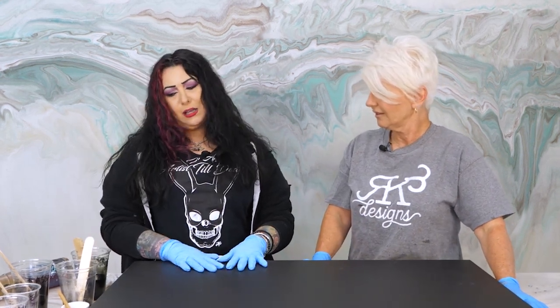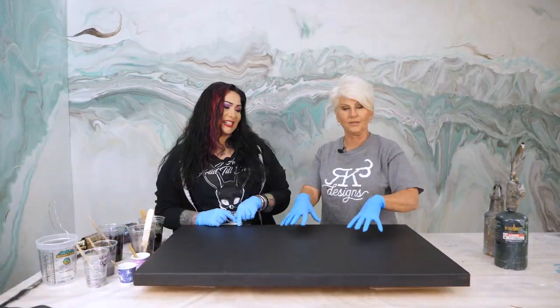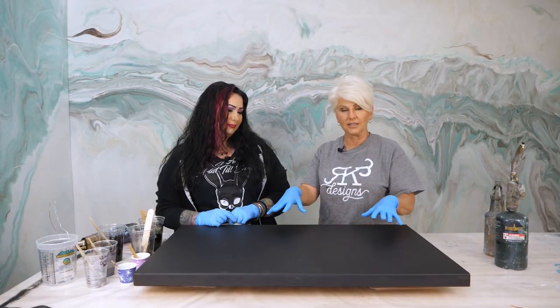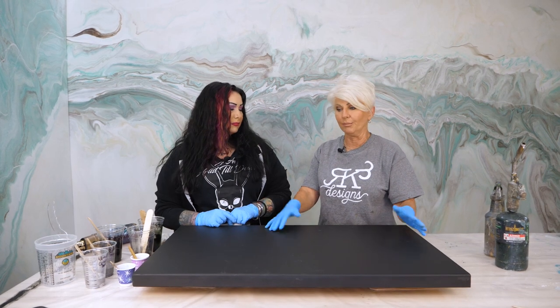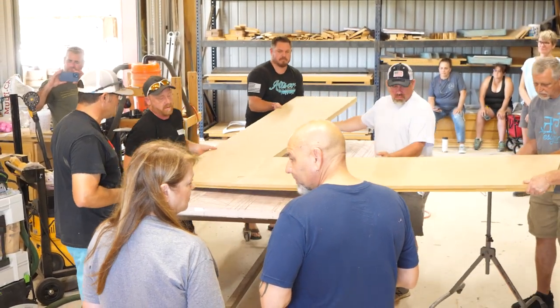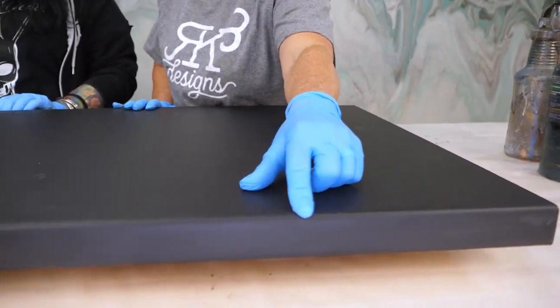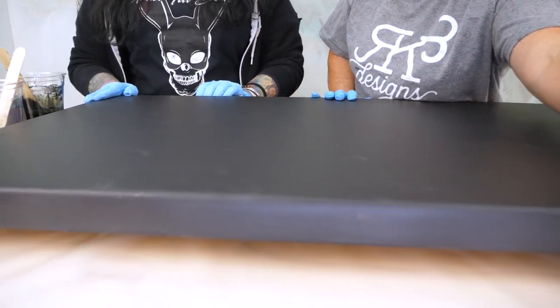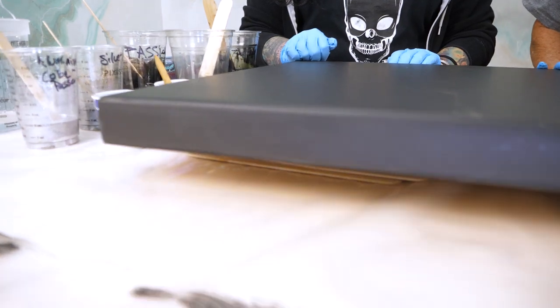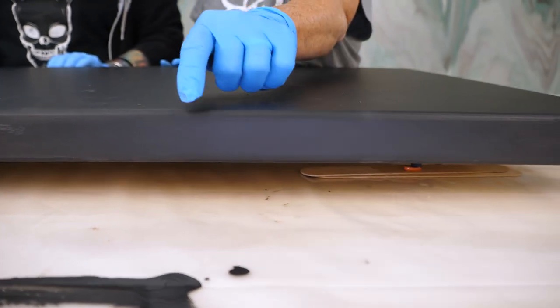So I named this Hollywood black marble and it is simple. It is black base and silver veining with some bling with a little hollow. What we've done to this point to get the substrate ready — we have a piece of countertop fabricated by our students, made out of MDF. It has been rounded over on the edge, a quarter inch round over and also on the bottom edge, so the epoxy can roll over and not build up surface tension on this edge.